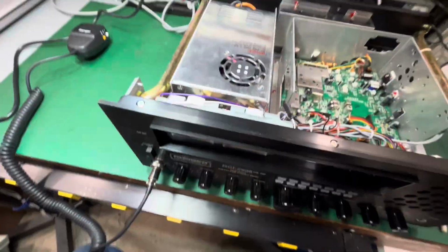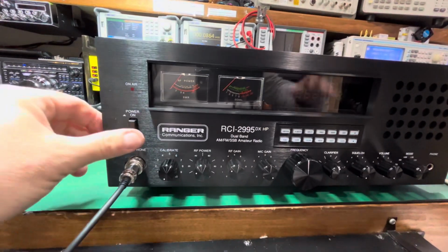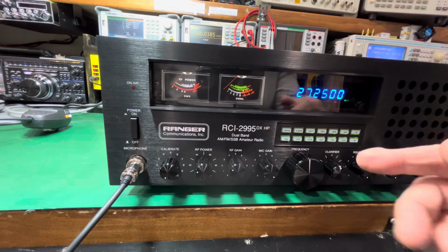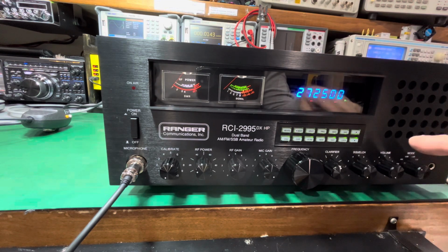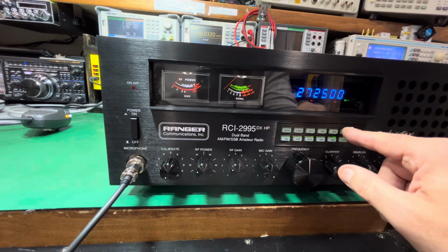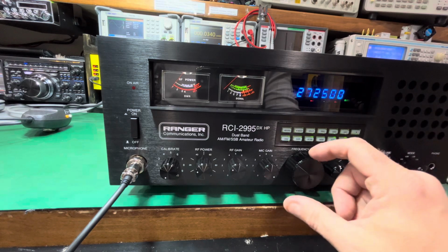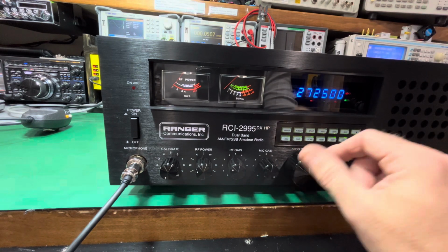We're going to come over to here, and we're going to turn the radio on. And there you go, guys. It's going to come up on 26000. I had already done this and forgot I was going to video this for someone, and I took it out and redid it. So it's going to come up 26000. You're going to use your shift key to move your digits back and forth, okay? Here we're on 27. I'm going to go shift to 2. You're going to go to whatever you want to put it on, channel, frequency, 50, right? I'm going to lock it because I don't want it to move around on me. So now if I move this, it's not going to bump around.